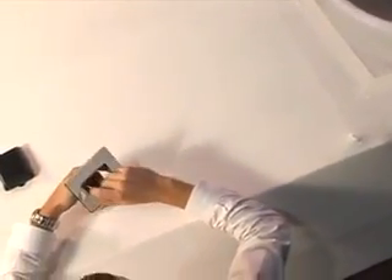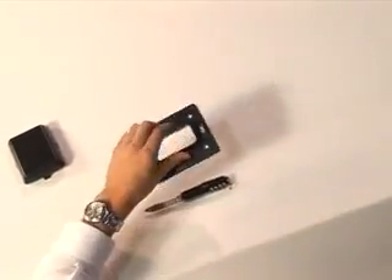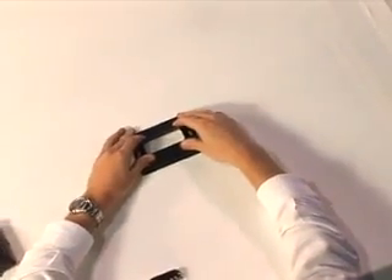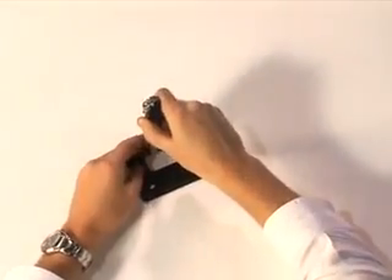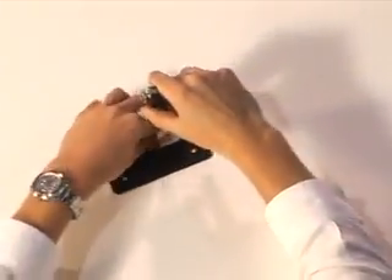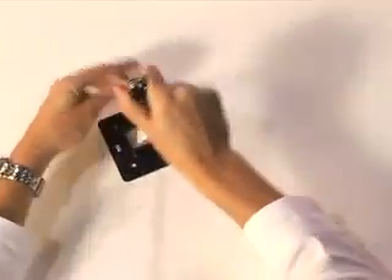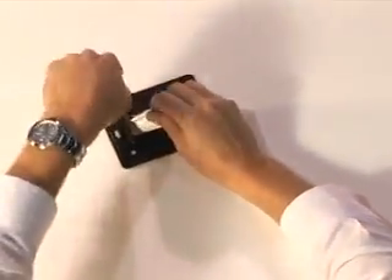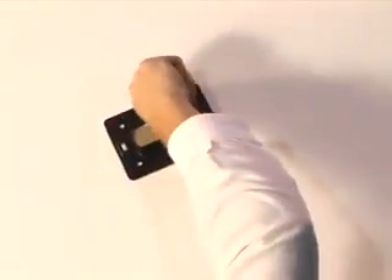The last step is to ventilate the cover using more of the DS 683 vents. You want enough vents to have cross-flow ventilation — on a 19-foot boat I would put in four vents. It never hurts to over-ventilate; you want as much airflow as possible to keep moisture down so your boat will be dry and fresh when you open it up. The vents also travel down the road well, so if the boat or machine is going to be transported you can still use the same vents.